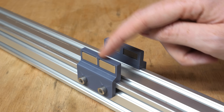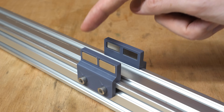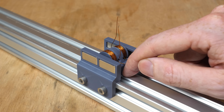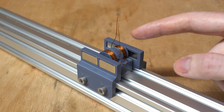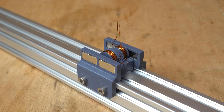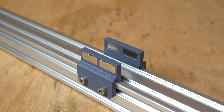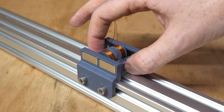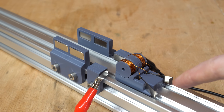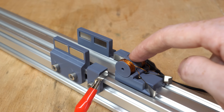Here is the first prototype. I've got these four magnets mounted to this rail. These first two magnets have matching pole directions and the second pair are flipped so their pole direction goes the opposite way. This way, if I have some coils on a sled and apply some power to the coils, it should create an electromagnet that will repel the first two magnets and be attracted to the second pair. So let's place it in position and just short some wires across these coils. That actually launched better than expected. I've now mounted two metal strips either side of the rail and made a new sled with metal strips that hang off the rear, in the hope that these will make contact with the contacts on the rail and apply power to the coils.